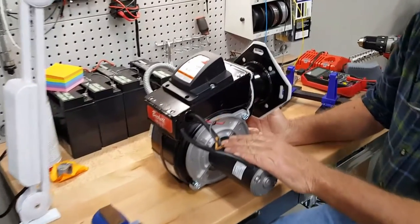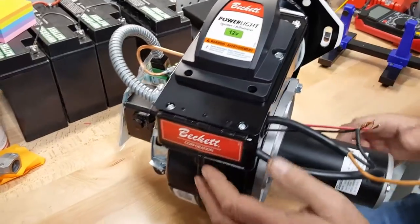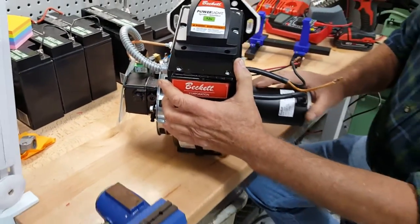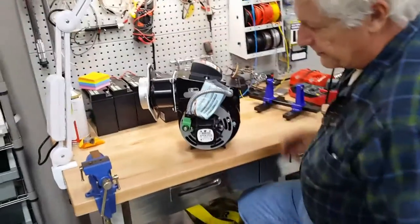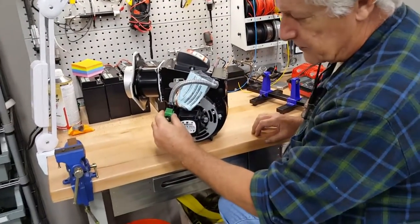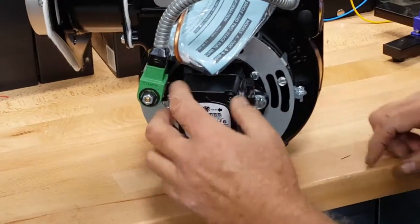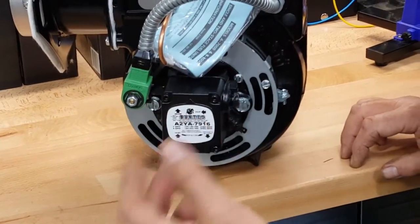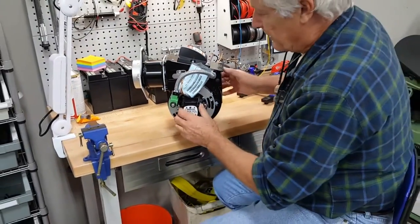This burner consumes more power. It has a more powerful motor, and the igniter is the same as the SDC, I would assume. We have the fuel pump and an additional electrical component — this is the fuel solenoid valve coil, and an electric signal causes the fuel to flow when there's a call for heat.